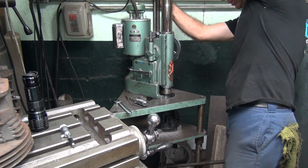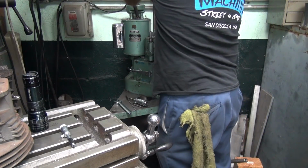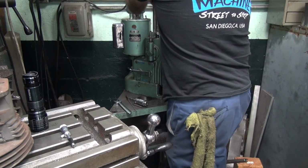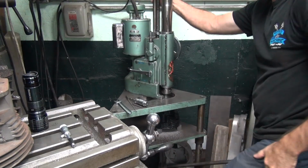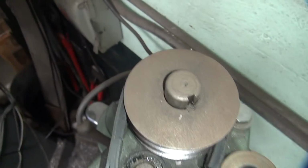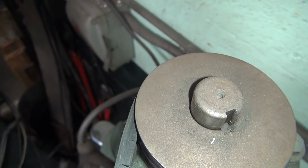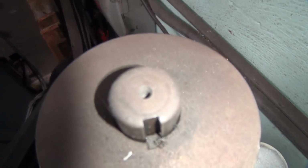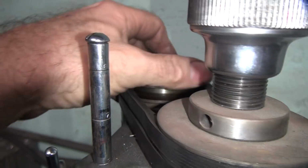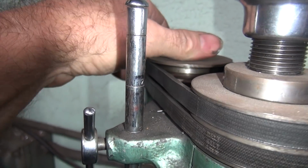There we go. Oh yeah. I bet you some kind of a set screw loose up in there. Pulleys are not supposed to be loose on the shaft. See the pulley up here, going on the shaft, you can hear it there. That damn light went off. You're going back and forth there. That shouldn't be doing that. Pulley should never be loose on a shaft. So my guess is there's some kind of a set screw that backed off and it's getting worse real quick.